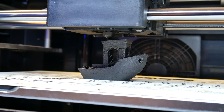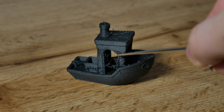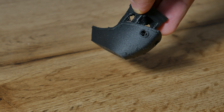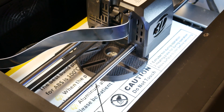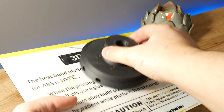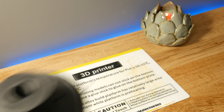I tried to print a small boat as a first test. The first one didn't turn out great — in the retraction areas there are a lot of thick strings or blobs, and those areas need more cooling. The hull was pretty nice though. I printed a new one with improved slicing settings but it looked even worse. Then I printed something more mechanical. Let's be honest — when you print carbon fiber nylon you won't print cute models. Nylon is a strong material meant for practical prints. So I printed another wind turbine part, and that model turned out really well, releasing from the build surface really easily. I now understand why this print surface is the way it is — it's designed for materials that typically have problems with sticking.